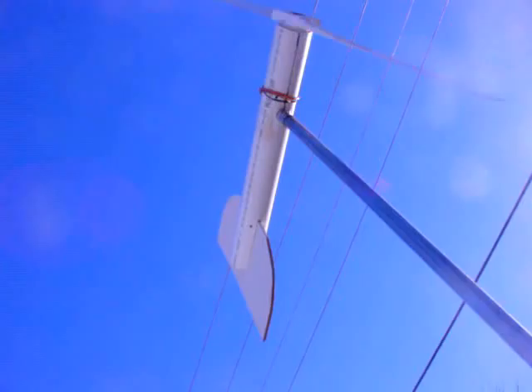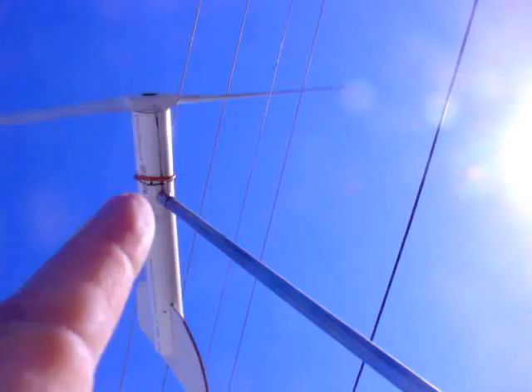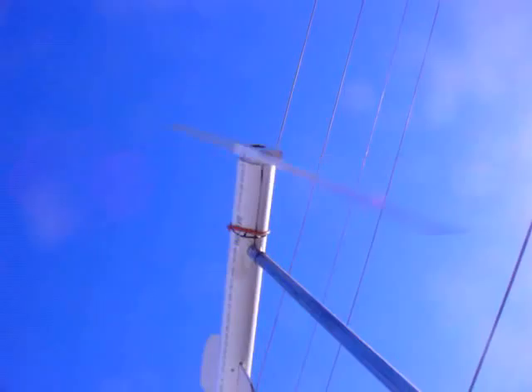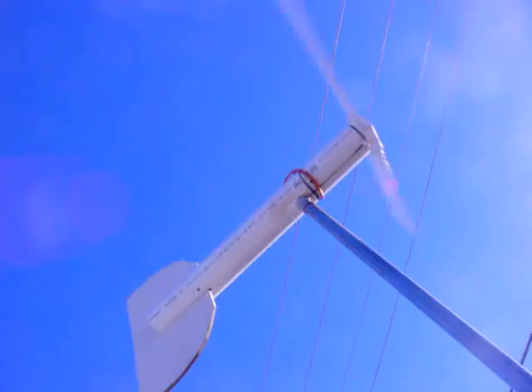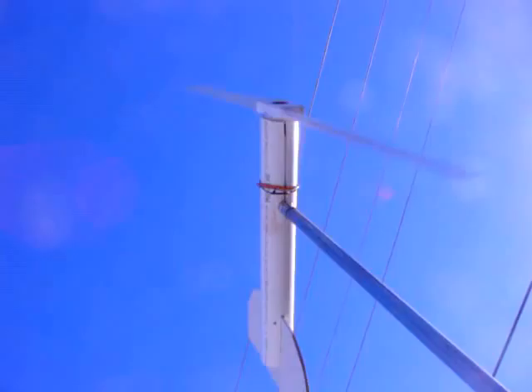You're probably wondering how I found the notch the first time with a Phillips screwdriver and a drywall stinger, standing at the top of a ladder at night after the wind had died down. I slid a light down inside the back end of the wind turbine, and before I put the motor in, I took my Sharpie marker and from both of those notches I drew a line from those notches to the center of the motor. Then I slid the motor back, making sure that the wire did not line up with that long slot, and as I got it all the way to the back, I could see those lines clearly. I sucked the screw in and turned it until the PVC started to push out just a little bit to give it some spring tension. The plumber's clamp was a little bit too big and would not adjust all the way down, so I'll have to get another one in a few days.